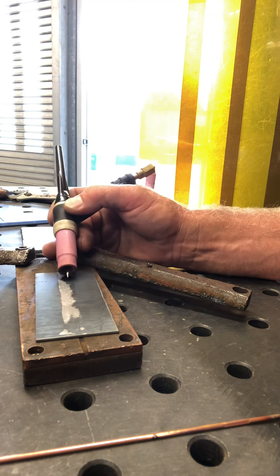Simple technique. The one change we've made here is I've taken these plates — this is 3000 series aluminum — and bent an edge up on one of them. Just one of them is all you need. Two of them will generate a hot spot with hot air that comes running up into your weld and makes a mess. We put this on with a press brake — I'll be sending out a chapter this week to illustrate that. This one's just cut with a hand shear, and I'll be showing you that as well. Just a couple live demos in class. Next week, TIG welding on aluminum — we'll see you then.